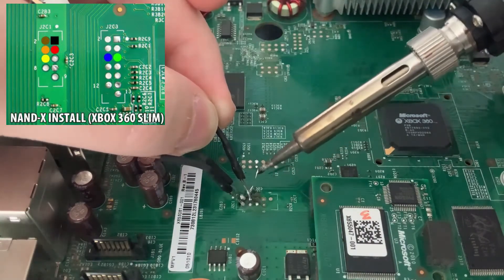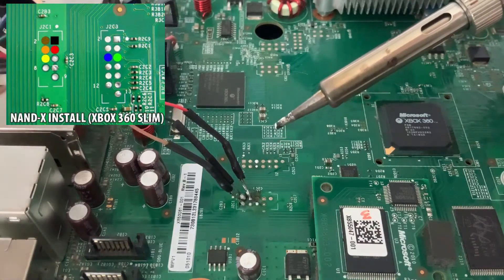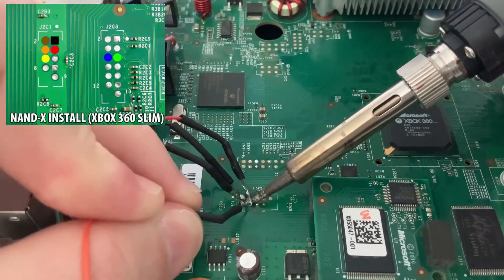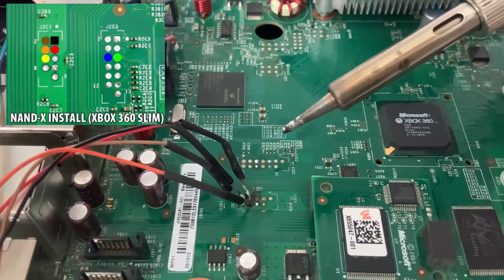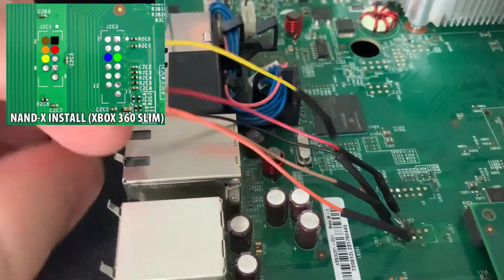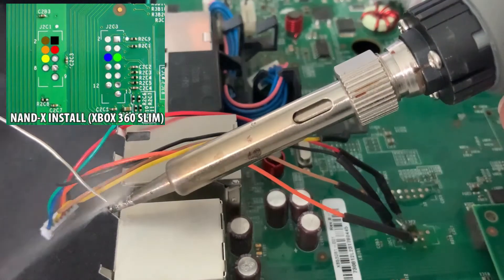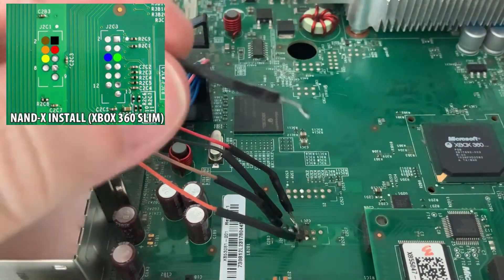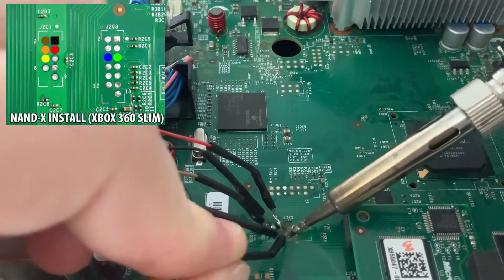There wasn't enough flux on that one. Then you want to do your orange, which goes next to the red — that point right there. I'd recommend you try to keep your points a bit straighter, but for the sake of the video I'm bending them out a bit so you can see the wire. Your yellow wire is your ground wire. You can actually use one of these little tab bits and just feed the solder on like so and use that as a ground, but I prefer using the point itself — it's neater. So same as normal: tap, tap, and feed.